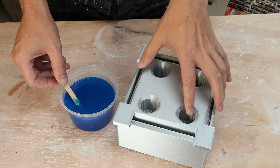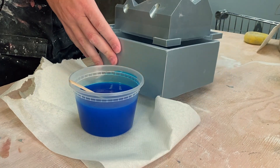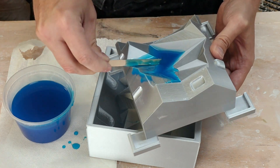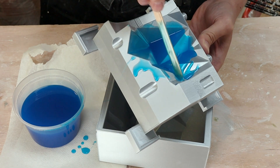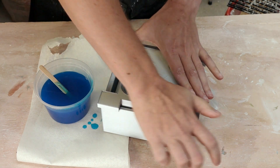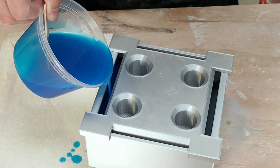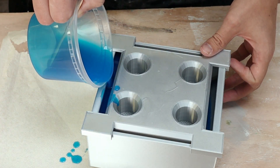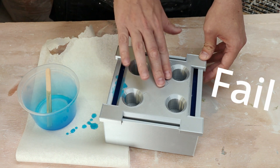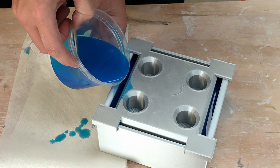Here's the silicone and here's my mold. I'm going to pour some silicone onto the face with all the undercuts — I'll spread it around and get it all wetted in, then flip it over and slowly pour the silicone in. Most of the silicone I mixed is in and I'm not quite up to the surface, so apparently I pulled the wrong number from the 3D model. I'll mix up a little bit more — that should be more than enough now.